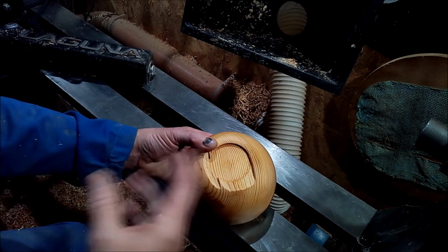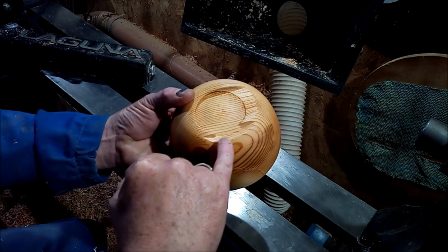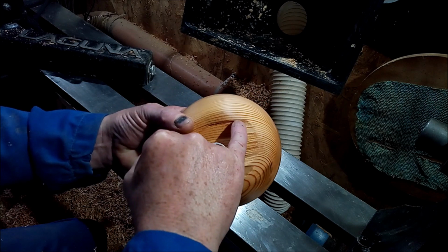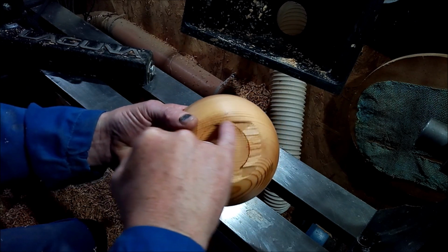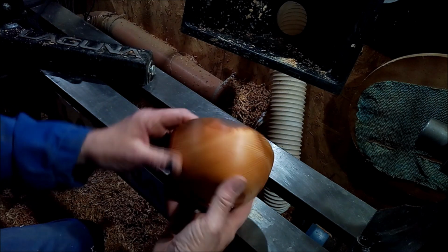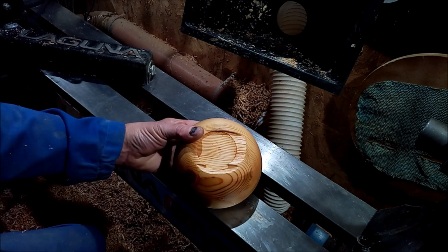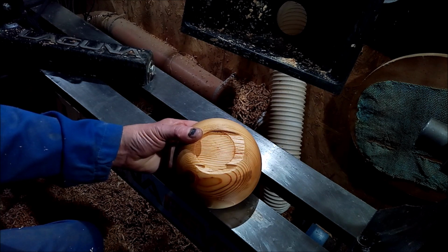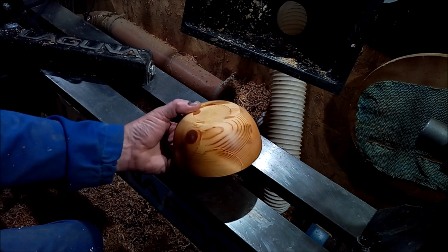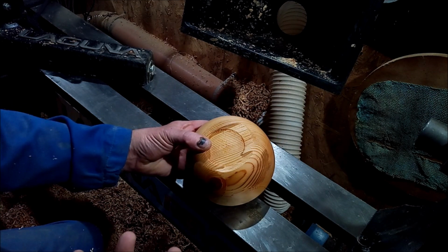They can blow. But if you look at it here, you'll see that where it went is on the rings. There's a perfect one right along that ring. They're the weak spots in the timber. Is that not great timber? It actually wasn't turning out too bad. I said it was just a bit of a fun challenge. Would a tenon have made much of a difference? Possibly, rather than the mortise? Possibly. But as I said, this is just construction timber. It's not great stuff. It's very, very loose grain.